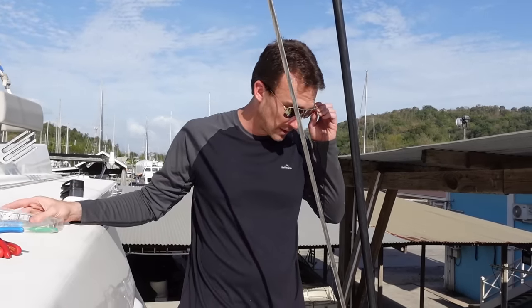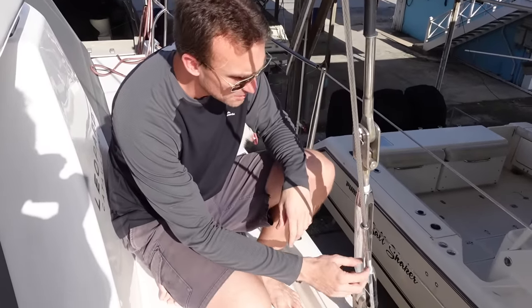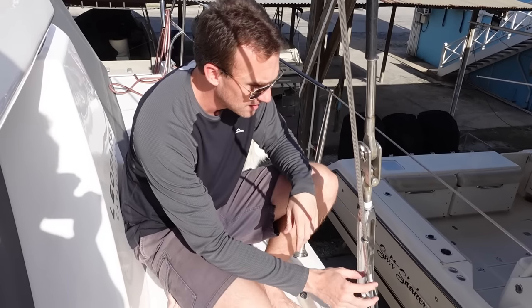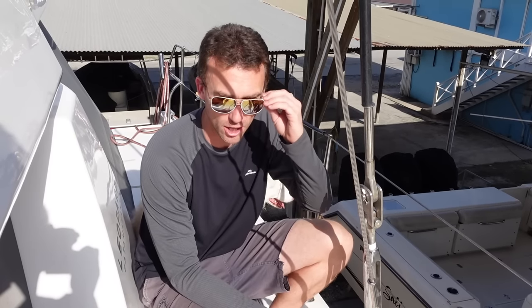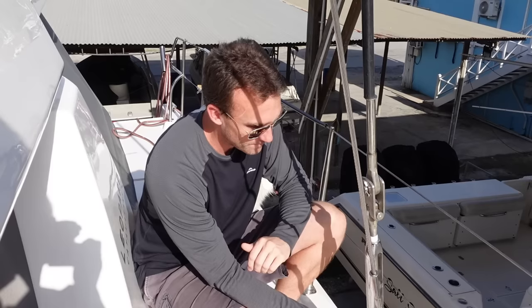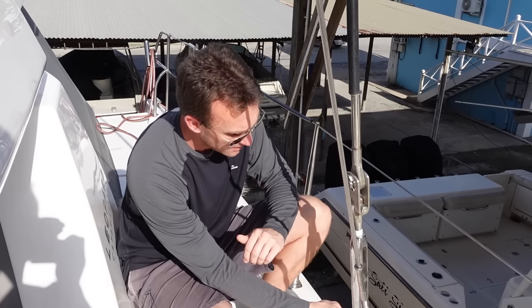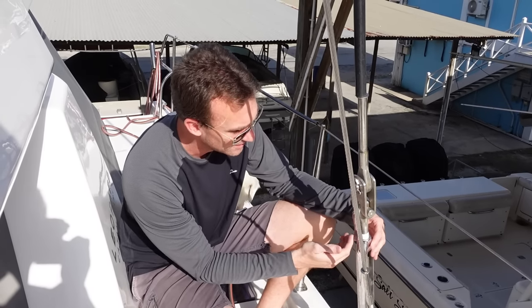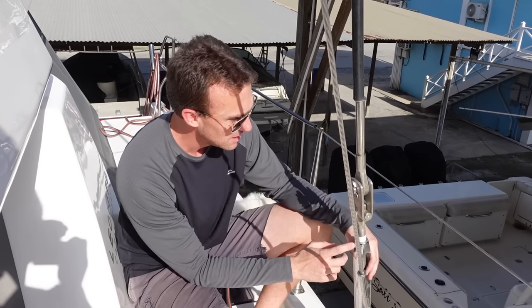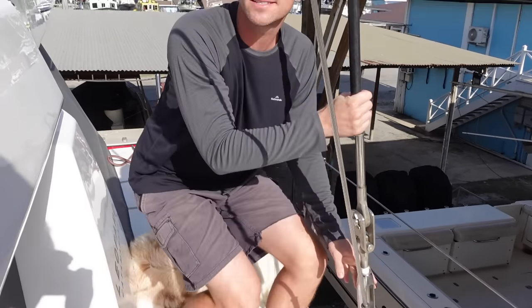So, where this tape is here, normally there's Tef-Gel, but because we're removing the mast soon, because our mast doesn't seem to enjoy being on, we put tape and marked it for various reasons. Anywhere that these soft metallic surfaces are contacting each other, it needs to be lubricated with Tef-Gel. Inside of here should be Tef-Gel, which also acts as a galvanic corrosion inhibitor.